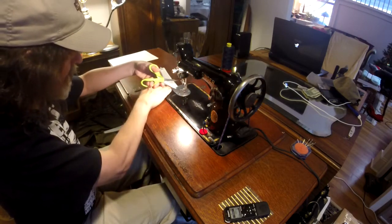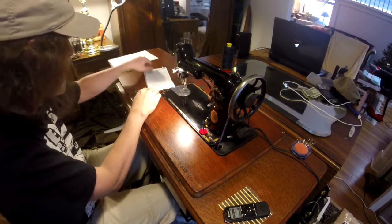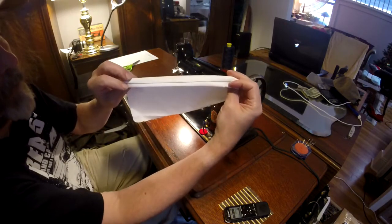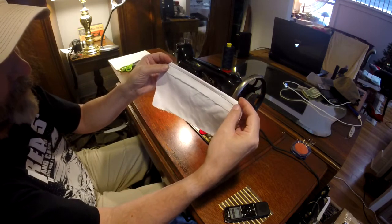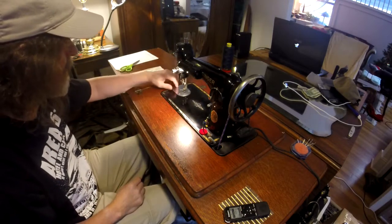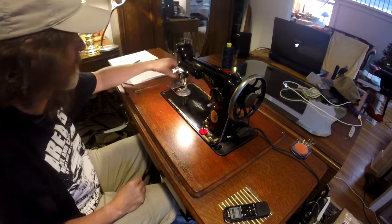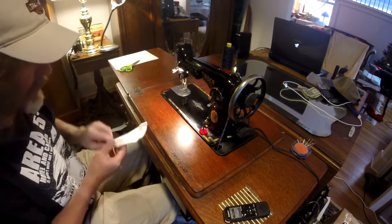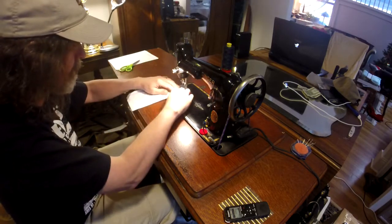I got it because it's a 201. Not sure if you can actually see that or not, but yeah, nice tight stitch. One of the problems I ran into was somebody had been kind of ham-fisted on the hook here on the race — the little clip for the race — and it was not lining up properly. That was causing a little bit of clicking, and I tracked that down and it works fine now.